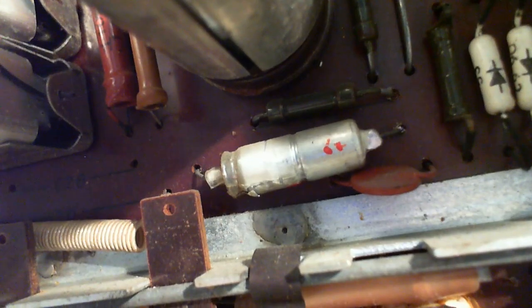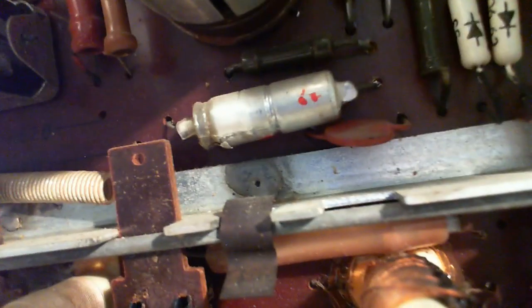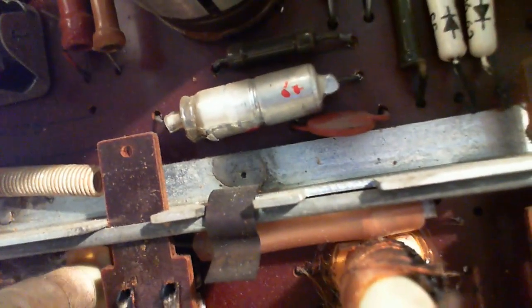There are about six or seven of those kind of capacitors in here. So here's one. This one looks pretty good though. Yeah, this one looks very good. Doesn't guarantee anything. A couple of diodes there. Electrolytic capacitor there. Gee, I wonder if that's the small electrolytic capacitor that's involved in the detection of FM. I wonder if that's the guy. Hey, something happened to him? Yeah, it almost looks like the shell has popped open on the left side there at the bottom. Something's happened on the chassis there, too.